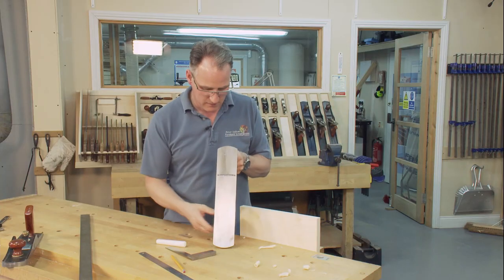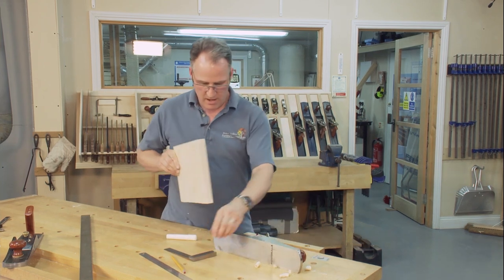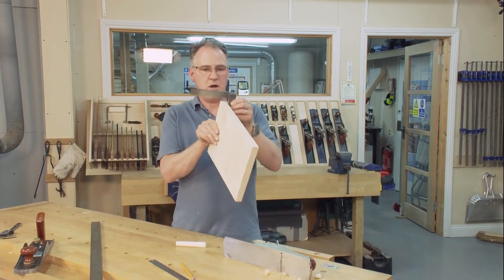Just double check again — it's not cutting there, it's cutting in the center, not cutting at the edge. It's probably quite a nice fine shaving. I'll check him for square, bring him out of there, and put him up to the lighter bit — otherwise it always looks good in the dark corner.